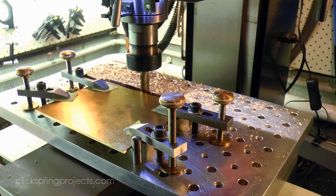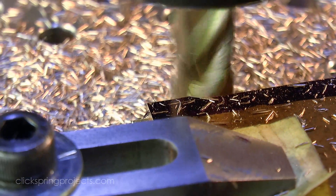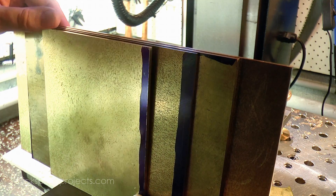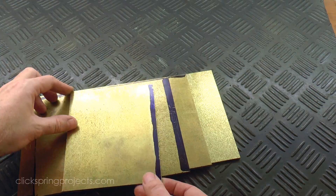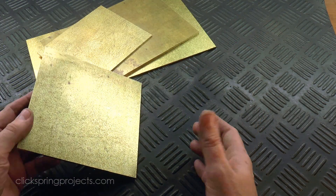But interestingly, not one of the features is carried through all four plates simultaneously. So it's clear I need an accurate method to bring the plates into register with each other, that gives me the flexibility to combine them as required. The clockmaker way to approach this is to align them in a top down stack, using tapered brass register pins. Each plate is registered with one below it, to lock in the relative orientation.